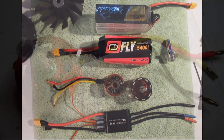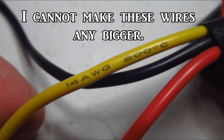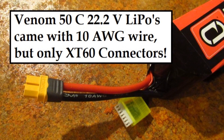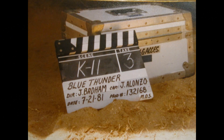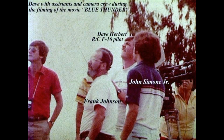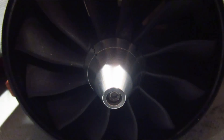Some said my wiring was too small. The wires on the motor were the same 14 AWG on the first failure with XT60 connectors. But with that second failure, I used the Venom 50C batteries that had 10 AWG wires, and that certainly offered no resistance to the ESC. Even so, when I flew it the last time and reduced the throttle to about three-quarter, that's when the fan locked up — it was like the brake came on, but the brake was actually disabled in the program. I think it did lock, as the nose cone unscrewed and the fan blades all came off when it quit.